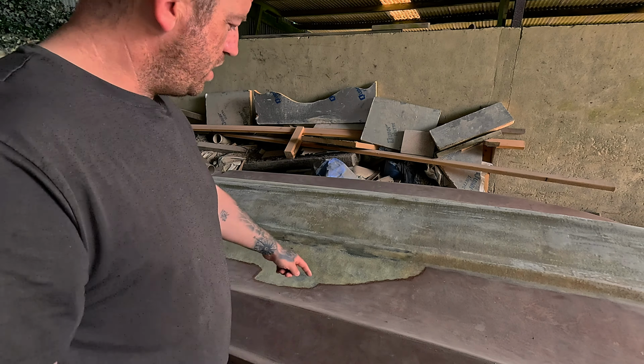We've actually got a little bit of cracking in the gel coat here. The crack here was severe. If I would have gone and painted over that crack, eventually it would have come back through. So what I've had to do is grind out the gel coat, which you can see here in this whole area. This is how far the crack run. I've got the flap disc on the grinder and I've gently ground it all out to get back down to the bare fiberglass.